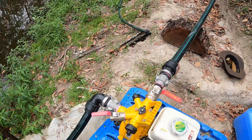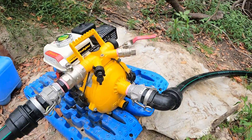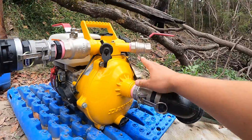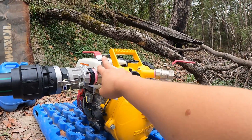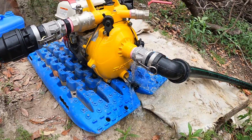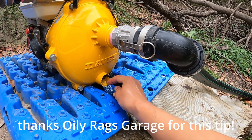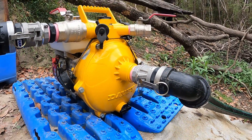Let's imagine that this one isn't pre-filled with water. Because once it's pre-filled with water, it's very easy to start - you don't have to prime it basically every time you use it. You just get it started, have the water shooting out of this valve here, and then once it's primed, close the valve off, open this one and the pressure runs to the main system. This cap here is what releases all the water in the pump, and you should do this every now and then because sometimes sediment builds up in there.